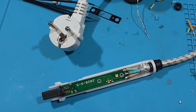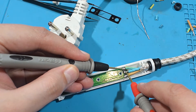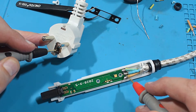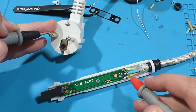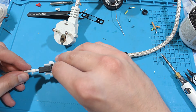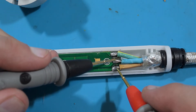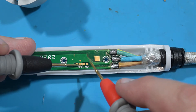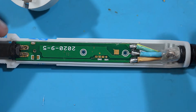Let's test everything with a multimeter in continuity mode. No shorts - great. Let's put the heating element in. The heating element is not a short, it's more of a resistor, but let's make sure - continuity check on the heating element. That's okay. Let's reassemble the soldering iron back as it was. I turned off the multimeter.